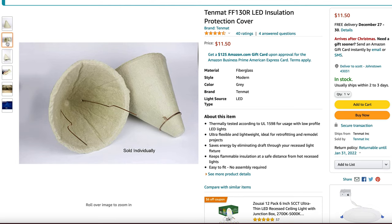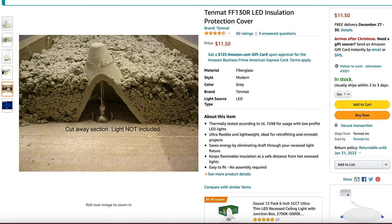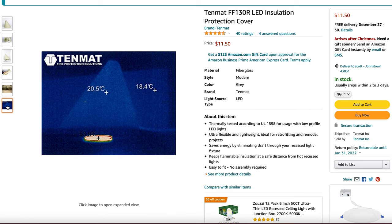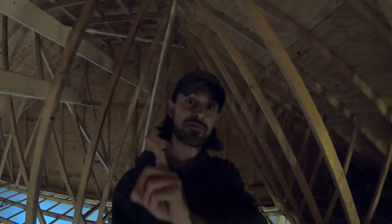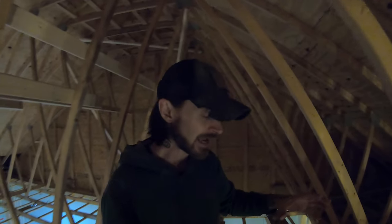It's fire resistant. They do make really, really expensive ones that are coated in fireproofing, and that will actually help with like a class 1 or class 2 fire rating score up in here. But because we're using LED lights, I'm not worried about a pot light overheating and catching the material on fire, because LEDs just don't get hot. But it's basically just a little bucket that you sit on top of the light, and then we can spray from the perimeter of the light to the top of the drywall, and that will air seal all of our lights